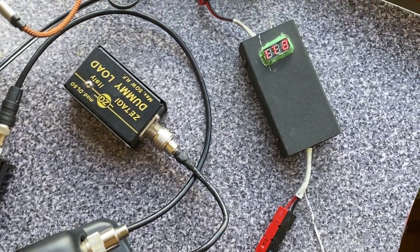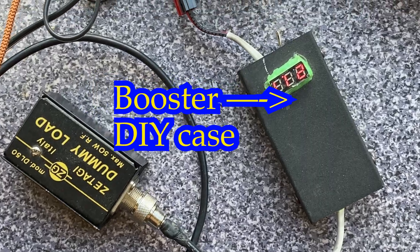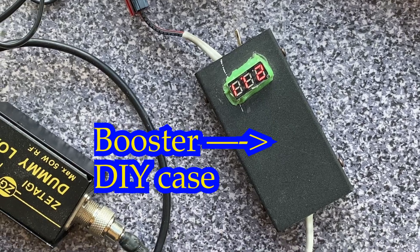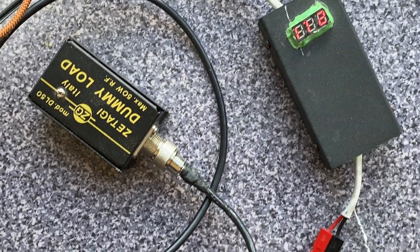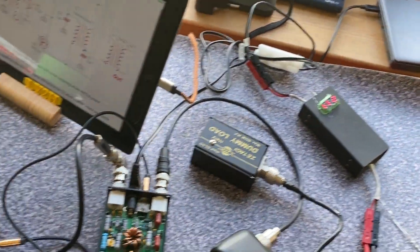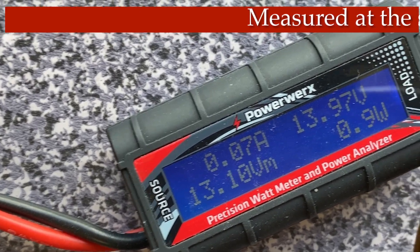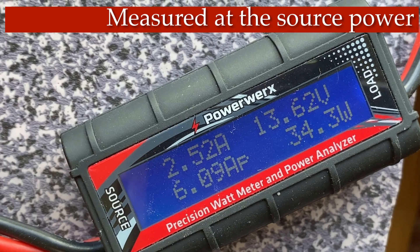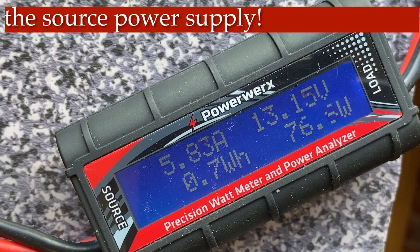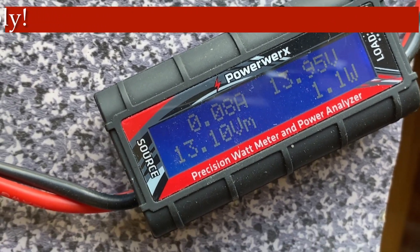There is a great variety of DC-to-DC voltage boosters. The only thing to be aware of is that some of them can generate noise on certain frequencies — in my case it's not terrible, just on one frequency I noticed it, so that's okay. As for current draw getting 45 watts output: about 5.9 to 6 amps — that's pretty standard.